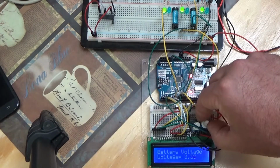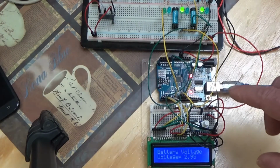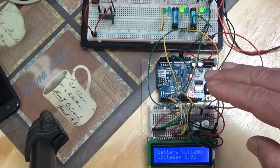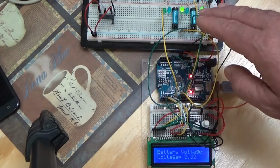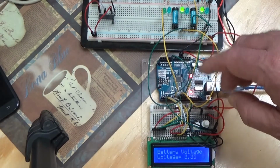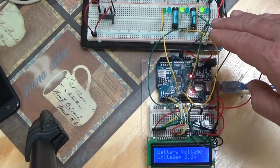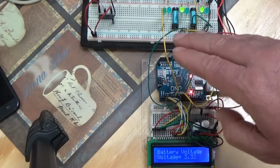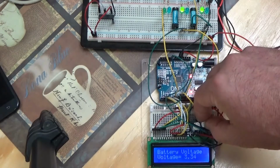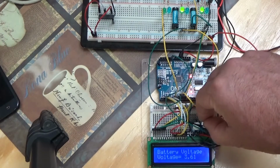I want to hit that lower threshold and shut off one computer and demonstrate what happens if the sun is sort of setting. There's enough power in the solar panels to power 2 rigs, but not 3. Alright? We got one rig shut off. There's still enough power in the system. We can still run these 2 rigs. But with that third one, it's not enough to power that, so that's kicked off. So anywhere in this threshold range, those two computers are going to stay on, okay?